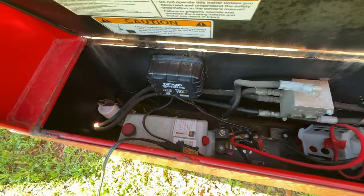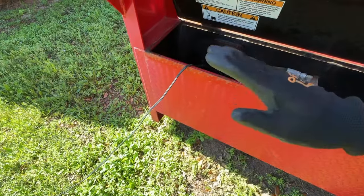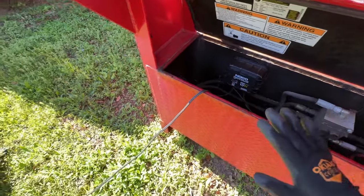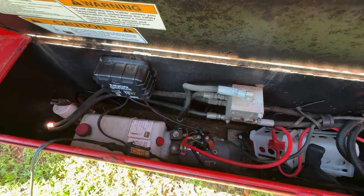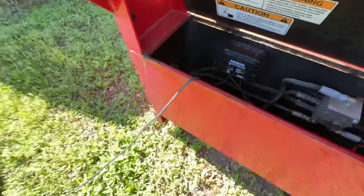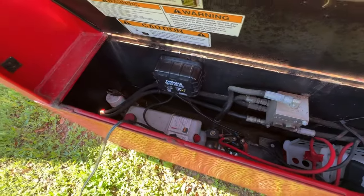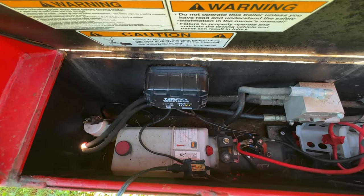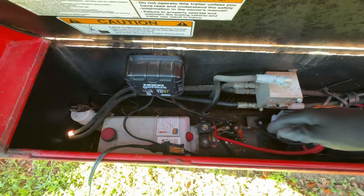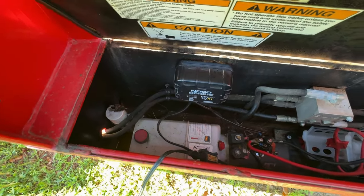It won't go up or down. This is a two-way pump, meaning it's electric up and electric down — mainly because the landing gear needs to be able to retract off the ground. If it were a one-way pump where I could simply raise the trailer by extending the landing gear, I'd only be listening for one click. But because it's a two-way pump and I need to retract the gear all the way up, I'm hearing two clicks and no movement. I've tested to make sure I'm getting power everywhere, tested the connection, checked the pump independently, and replaced the solenoid — still no dice.